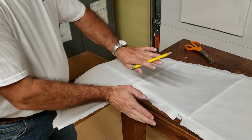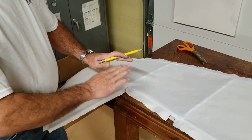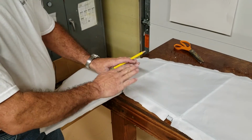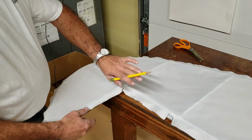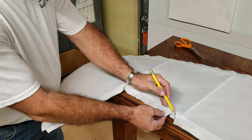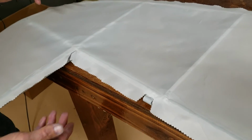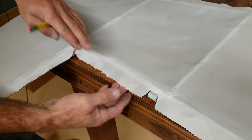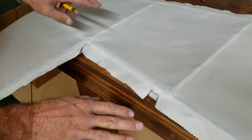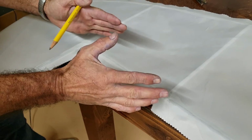Sometimes it's best to lay it against the aluminum part of the wing and take a razor and cut it and iron that little edge down, like a paint line or something. That way your fabric doesn't come over it. But there's times you're going to use a razor, and a lot of times you can take a little thin glue and wet the fabric and then let that dry. That little bit of thin glue dried in there kind of sets the fabric.